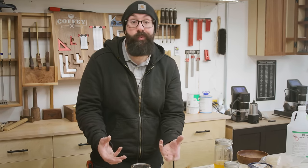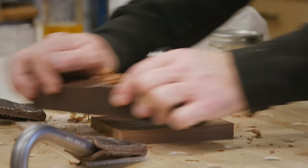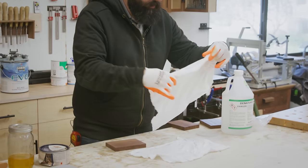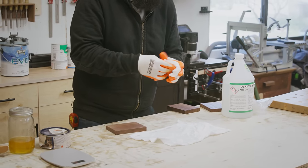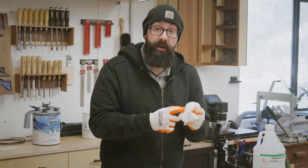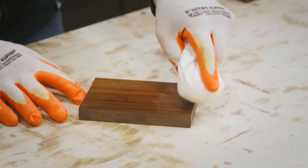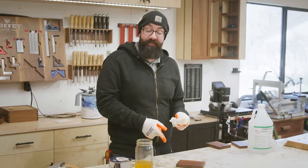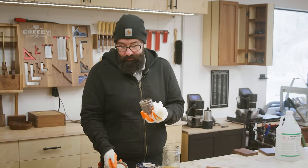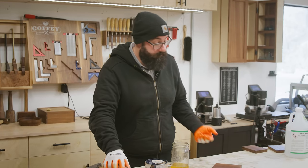There are a lot of ways to apply shellac, but the way I like to do it most is the way my friend Russell Kieselbach taught me: hand-plane the surface, then sand it with 400 grit and then 600 grit, and then start applying your finish. I like to use a white rag to apply — a trick I learned from Fine Woodworking magazine, I'm pretty sure it was Mike Pekovich. I ball the rag up, put it in another rag and encase it, and that ball becomes the reservoir for your finish, because all we're doing is wiping it onto the surface. After I'm done wiping on the first layer, I put the rag in a small mason jar — since this is denatured alcohol it will evaporate — but kept in a container it won't dry out and you can keep reusing that same rag.